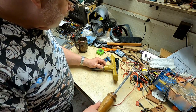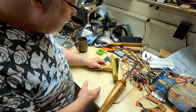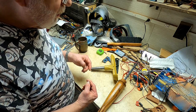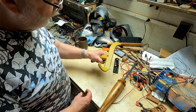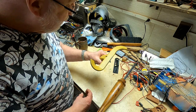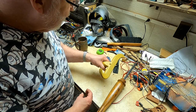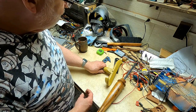I'm going to try it on cast iron — that's where I say this is an experiment. The first step is to get one of my small tools, cut a piece small enough, put it on my metal lathe, and turn it so I have a dead center. It won't rotate, so it'll be a dead center rather than a live center, but that should be fine for our purposes. Let me show you that process.